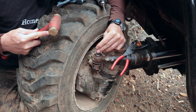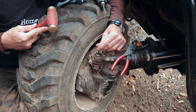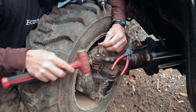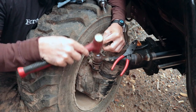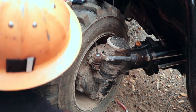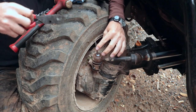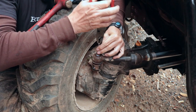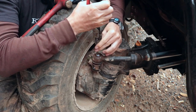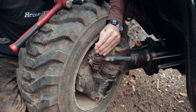So now, if I can get the easy-out to fit into the end of that fallen piece, I can grab it, get the thread started, and back it back out. That's the reason for the brass hammer — this is hard tool steel, and you don't want to whack on hard tool steel with a hardened-face hammer because it can break, it can chip, and it'll probably go right in your eyeball. Things have a funny way of happening like that. Let's gently coax that up there and thread it back out. I can feel it there.